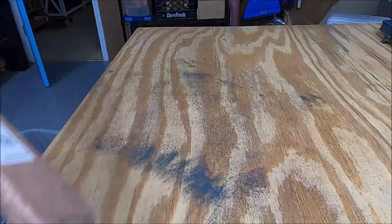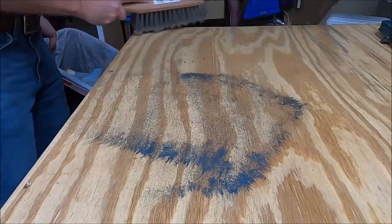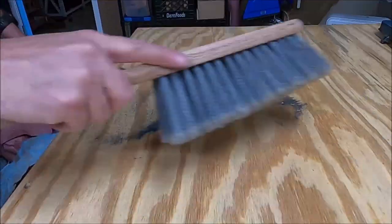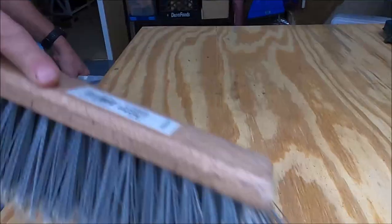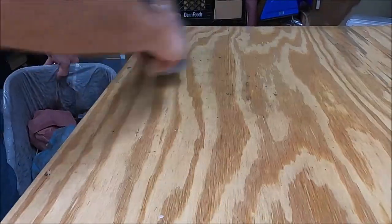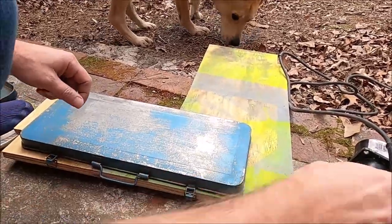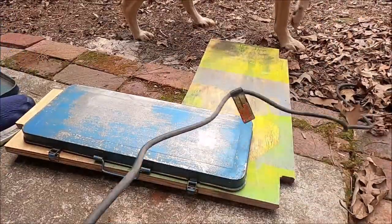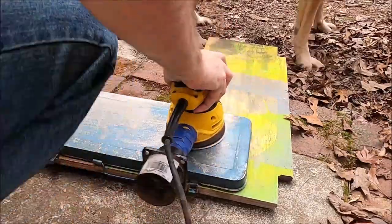You can see all this paint — not much actually came off the good metal. This is more coming out from sitting on top of rust, just sections that are bizarre. Not a big deal — I'm going to repaint anyway. After using the wire brush and getting the major pieces, I took some 120-grit sandpaper, put it on the orbital sander, and went to work outside.